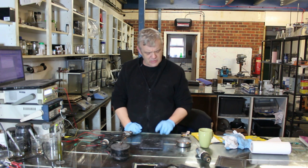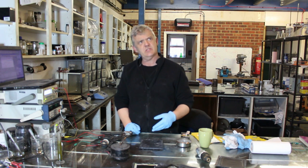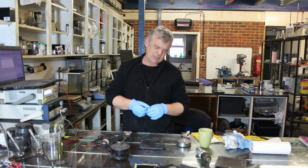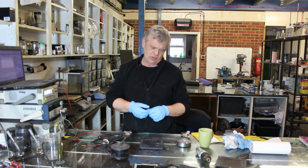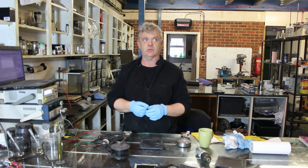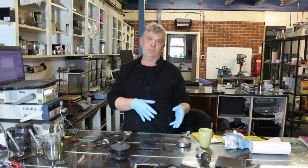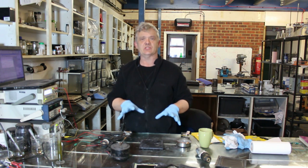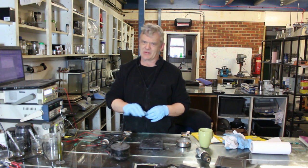I did look up the competition on this. On Alibaba they were advertising a Maxwell supercapacitor at 16 volts and 500 farads, and they said it was 20 centimeters by 20 centimeters by 22 centimeters, weighing 4.5 kilos. Comparing that to something like a green cap capacitor — that's 500 farads at 2.7 volts and weighs about 60 grams — the whole equivalent of this would be about 600 grams made out of green cap supercapacitors. So about a kilo sounds about right for the competition, whereas ours is 200 grams — much, much smaller.